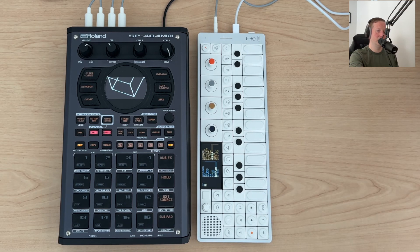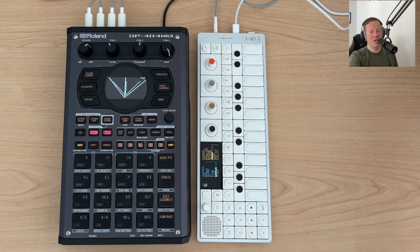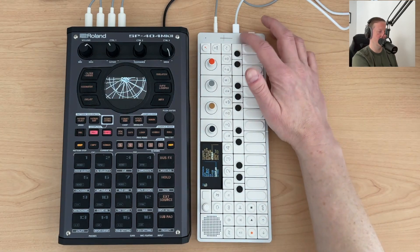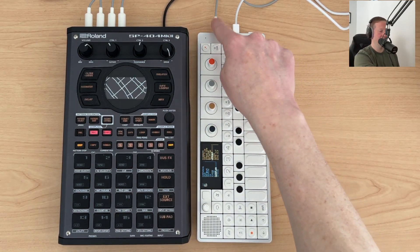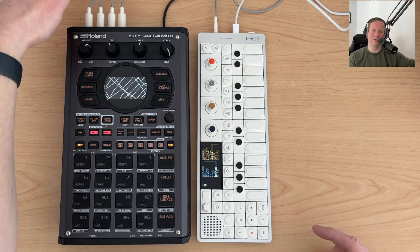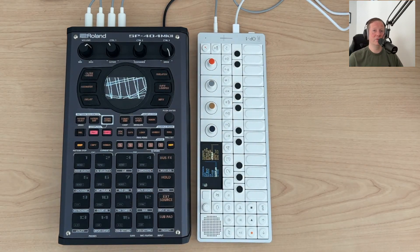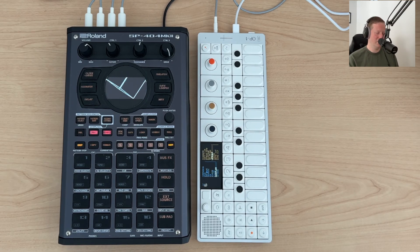You may be able to hear the noise just coming in and changing. I'm going from the computer into here, using the ground which is then getting passed over to this cable and coming back into the SP404 Mark II, which is going over to my mixer, and then the mixer is going back into the computer. We've created a big loop where the ground is just feeding into each other and passing along.